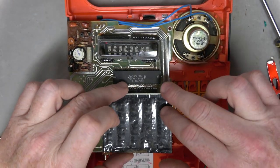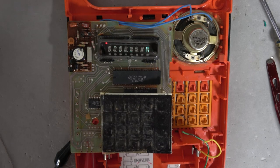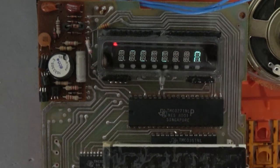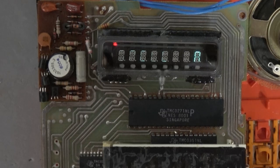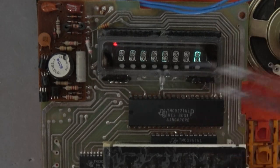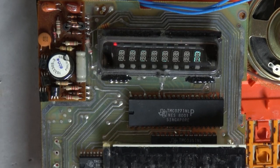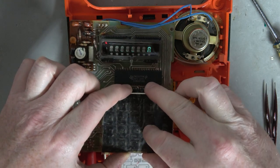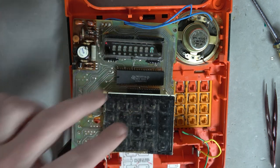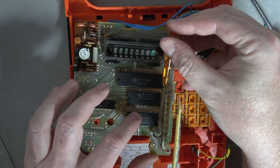This is actually starting to look like that scene from E.T. Let me try turning off these lights — you can see it. It should say 'Spell A' but it looks like most of it's degassed. That's too bad. VFD is Vacuum Fluorescent Display, so they can degas and basically fail over time. There is a potentiometer — I wonder if that affects just the volume. Let me adjust this part.